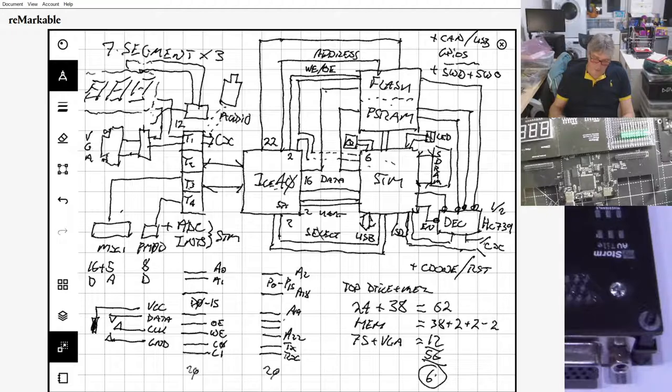Or you could insert data into the running system. And the STM32 could be a master on the bus in here, because you've now got a 16-bit data bus between the two. Effectively. It's not memory mapped, but it's pretty efficient, pretty fast. What you don't have actually is this. That's not there. You've got SPI as well, so you can run your UART over the SPI. It's not a problem. Really easy to do that.